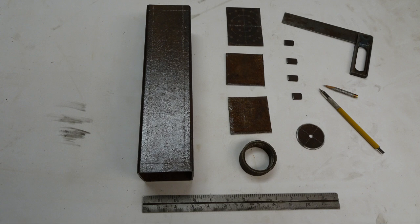In the third column on the right are the four tabs that will weld onto the burner body of the manifold to act as stops and hold the manifold at the proper depth in the chamber of the forge. The bottom round cutout is from the hole saw where the inch and a half pipe comes in and brings in all the air and fuel.